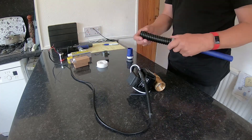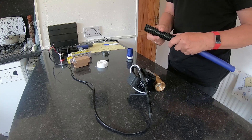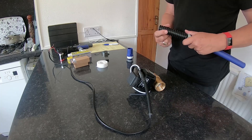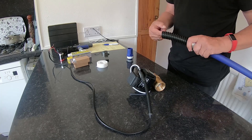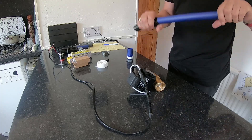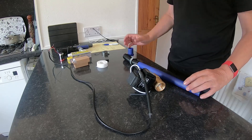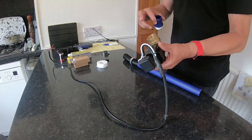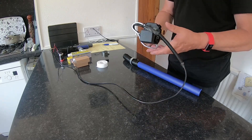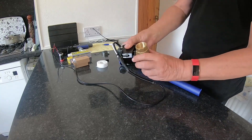The usual curly flexible waste — this black one here — it's got a smooth inside, which is helpful. That's 26mm inside diameter and it will actually push and seal quite well onto this blue pipe, depending on what your particular caravan layout is. These are one inch BSP, the connectors on the end. You can see the valve there.